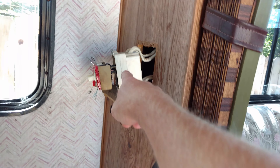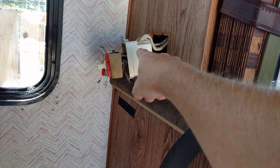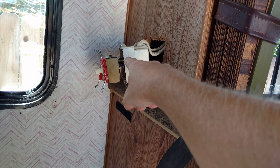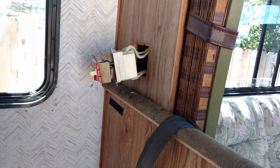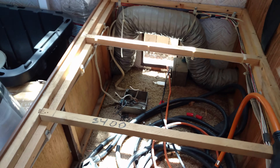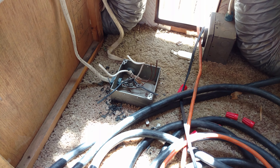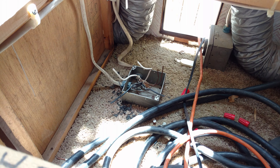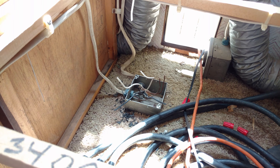I found a flaw inside this box — they had packed it too much, and some of the rubber split. So some of the wire was exposed a little. After 30 years, it split. So we have to double-check, triple-check all that all around the RV everywhere. Disconnect some stuff, cut it, get rid of it, maybe run a couple new cables if I need to — no biggie, it's pretty cheap. That way I know it's fine.